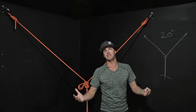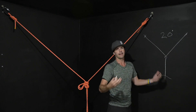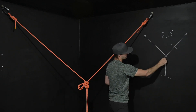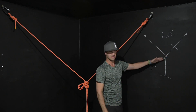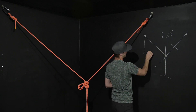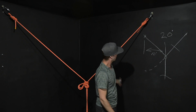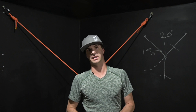Let's go a little bit deeper and figure out what's going on here. Why isn't it acceptable? Well, if any part of one side fails, then this will basically come down and you will drop and swing. We cut this in half — that's 10 feet — not to mention any additional swing. Definitely an unacceptable swing in the world of rope access.